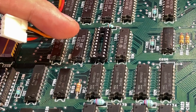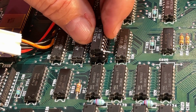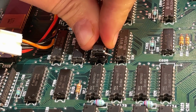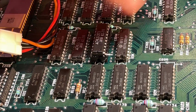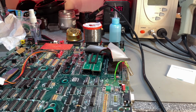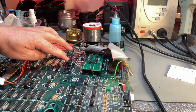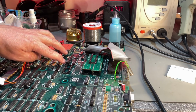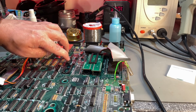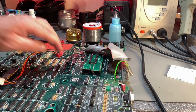So like that. And the same for chip U3J. There we're gonna lift pin 1, as I already did. Yeah, sits well into the sockets. Alright, the next step is to solder in 3 wires. One wire goes from pin 1 on this chip, the lifted pin, and then there are 2 wires from this chip, but not to the lifted pin, for 2 other pins. And soldering wires onto pins on a chip can be tricky, so we'll see how that goes.